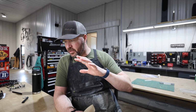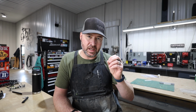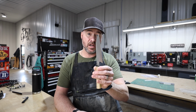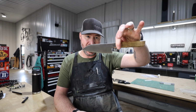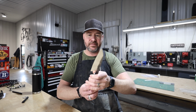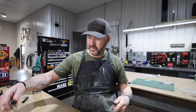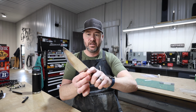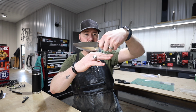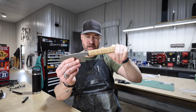And you know, when I think about knives in general, it's very important to think about the intended use of the blade. You know, this knife is for delicate kitchen tasks. It's not a big knife. It's like a little petty. And even thinking of things like the angle of this, I've got clearance for my knuckles when I'm on a cutting board. That's something I didn't always do. This one, I have it just because this heel is pretty big, but even so, I've got less clearance to a cutting board with this blade than I do with this blade. It's because I angle my handles up a little bit.